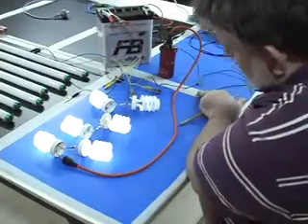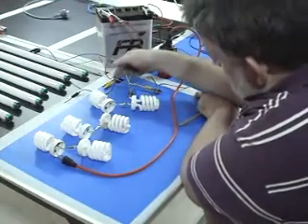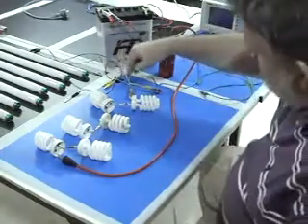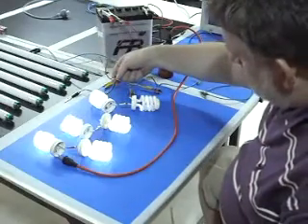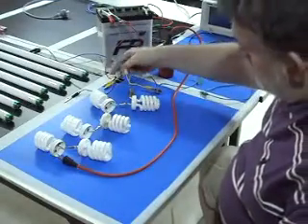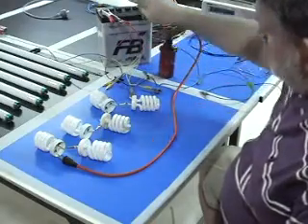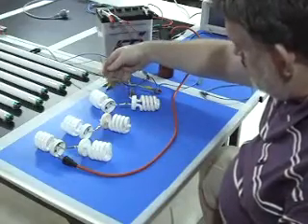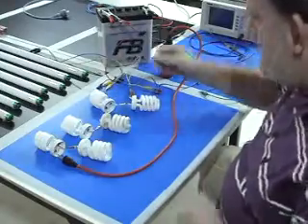Let me try and turn it over a little bit, turn it like this. Nothing. So look - I am moving my finger around the 2222 chip, my hand, everything. But when I come to the bottom, it comes on. Touch - go off. Let me move this cable out of the way so you can see better. It is off. Come to the bottom of this 2222 chip - that is the thing.